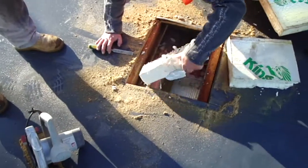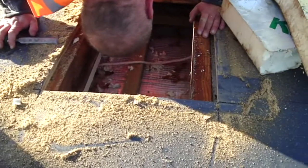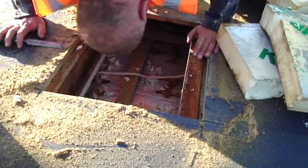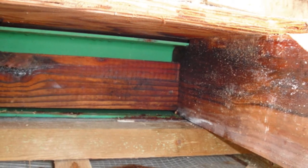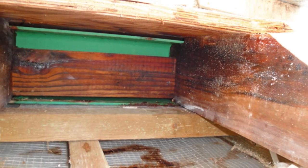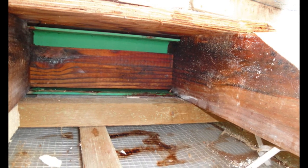So if it's a problem with moisture in the roof space coming up from condensating and running down, how do you stop that happening with a new roof? When you look at this photograph here, you can see there's an awful lot of moisture in the timber. And you can just see that the timber's started — there's some white at the bottom of the timber on the right hand side. So you can just see it's starting to show some fungus growing on there. So the first stages of rot have just started.